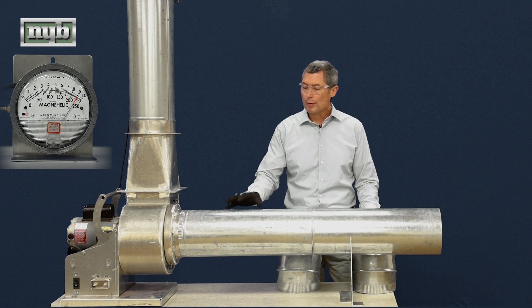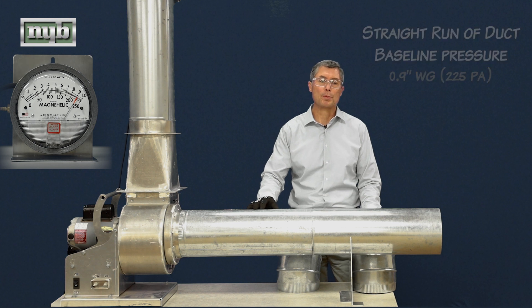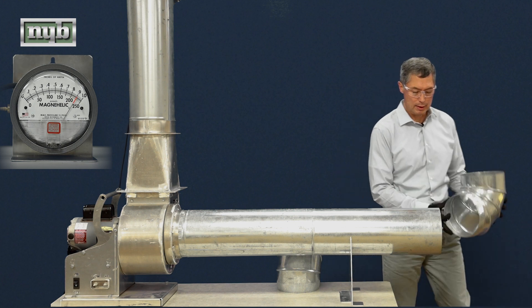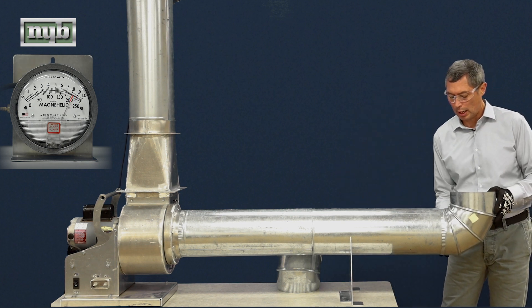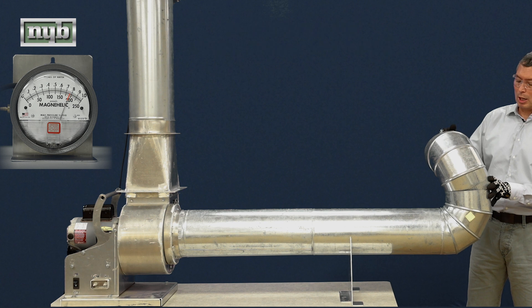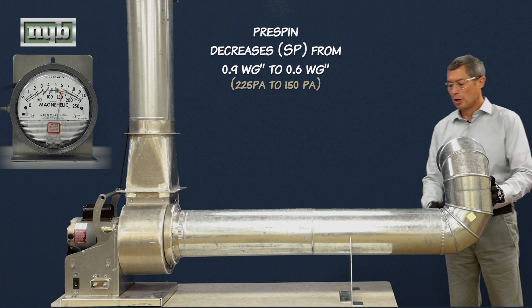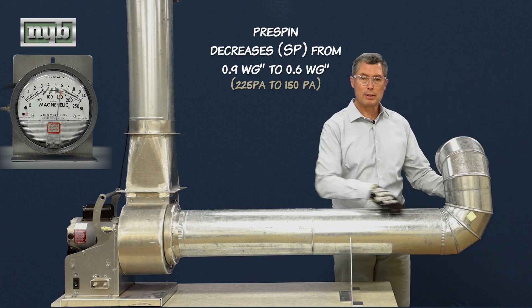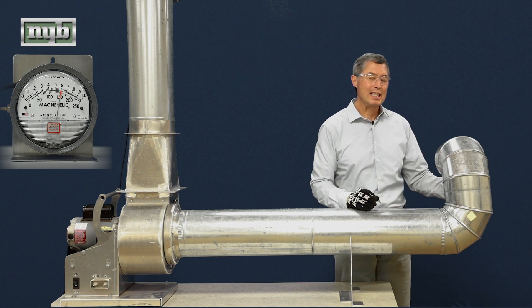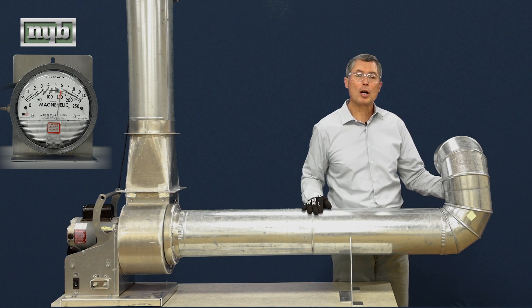On to the second part of our demo. What we've introduced is a straight run of ductwork, and we're going to see if that affects or changes the way the fan performs with a pre-spin corkscrew. We'll put this onto the inlet — this is our 90 degree elbow, no vanes, just a 90 degree elbow — and we're going to put this second elbow on in pre-spin configuration. Notice during performance that despite this run of ductwork, the pre-spin elbow configuration is almost the exact same performance as when we had this at the fan inlet. We'll talk about that in our final thoughts.